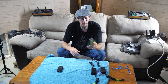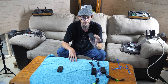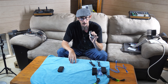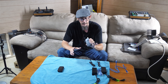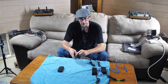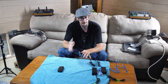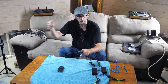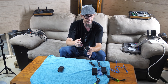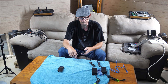DirecTV uses this on their systems. I'm not a DirecTV guy so I don't really know exactly how they use it, but I know they use it for their internet stuff and their systems. Just to let you know, these are only rated for up to 100 megs. What we're going to do today is test a 10-foot cable, then go to 100 feet which is the rated max, and then go even farther at 200 or 300 feet to see if there's any speed degradation past 150 feet.